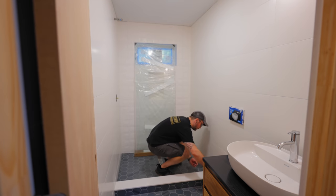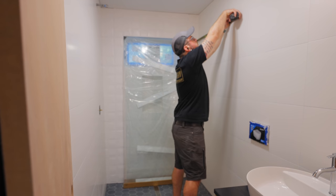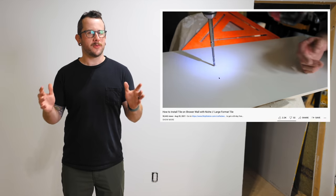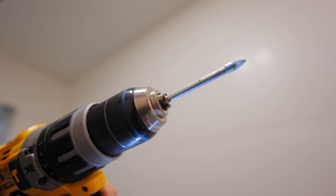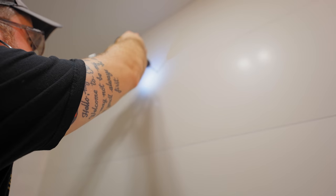I located where either end of the rail needed to be mounted on the wall so I could get the brackets attached, and I made sure to double and triple check my measurements here, as the last thing I wanted was to drill a hole in the wrong location on my freshly installed tile walls. You might remember me having trouble drilling pilot holes with my masonry bit in my wall tile video, since the bit kept walking around on me. I got some great tips in the comments — you guys recommended I use a glass drill bit to drill holes in the tile instead, and this worked great. The pointy glass bit stayed in place and made quick work drilling the holes in the tile.